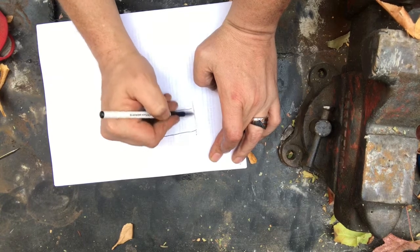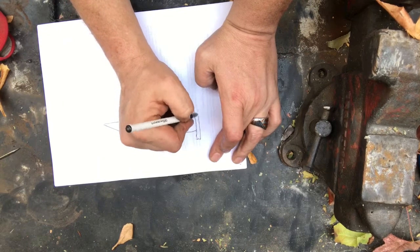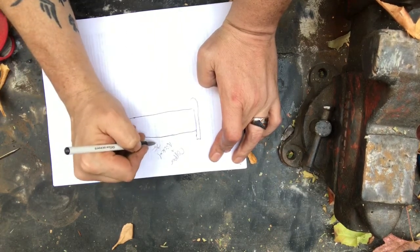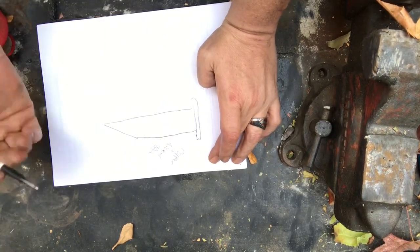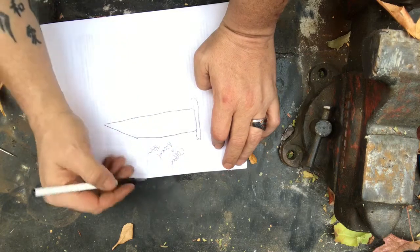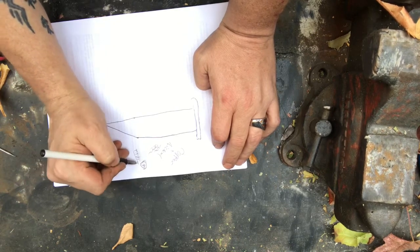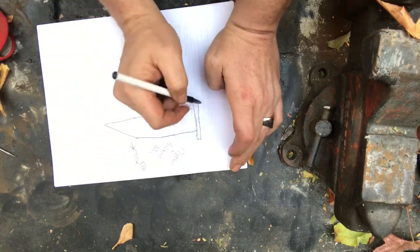Then this is the guard. I'm probably going to mispronounce this. It's called mokume-gane, where you take copper and nickel and forge them together and you get this nice little swirly pattern. Sounds kind of cool. I'm gonna make it a bit cooler because I found out that Jay is interested in old coins. So for the copper and nickel, I'm gonna take a stack of quarters, boom boom boom boom boom, like so, weld them and then smash down. And that'll be my mokume, so it'll be made out of coins.